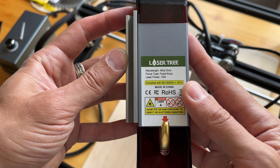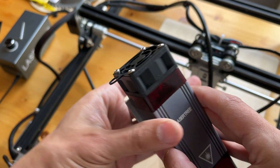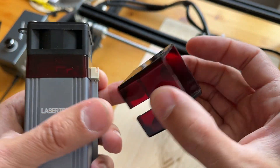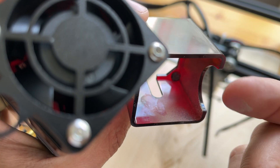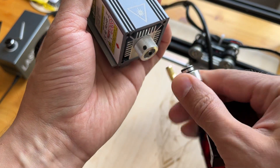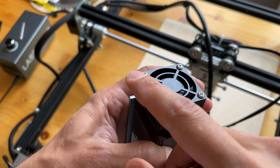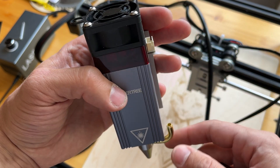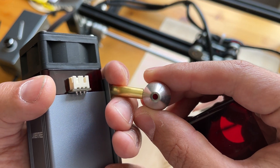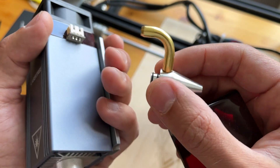Let's look at the laser module. The model has 10 watts with a fixed focus. On top there is a small cooler for heat dissipation. The cooler is fairly tight and in principle comfortable to work around. It has a magnetic shield and the cooler covers the lens coating during the engraving process, so it also needs regular cleaning. You can rotate the module in a convenient orientation for you, for example so the air nozzle is on the right side instead of the left.